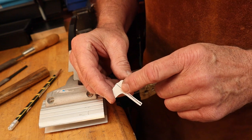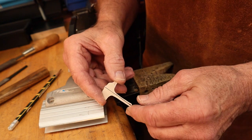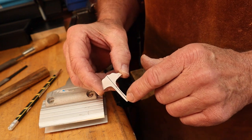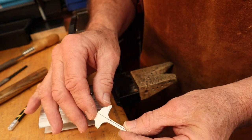I want to put a single line fold down the middle of this leaf, and as you remember, we normally would chuck it up into the vise and then bend it on over, and then we can do our forging. But this is awfully thin right through here, and so I've got to find an alternative that I can use to hold the metal to bend it on over.